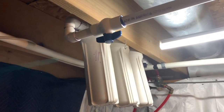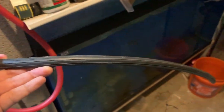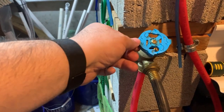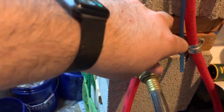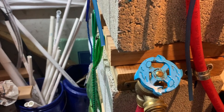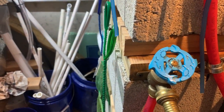From those three filters the water goes along this pipe. First we see this T — what's the T for? It goes down this little PEX tube to a spigot down here, which I use to fill buckets, and with a longer hose I can fill empty tanks. This is the SharkBite spigot I mentioned in Friday's video — it's got a SharkBite PEX connection and I don't really like it; you don't get enough grip so it can be hard to turn. Maybe it's arthritis or it just sucks.